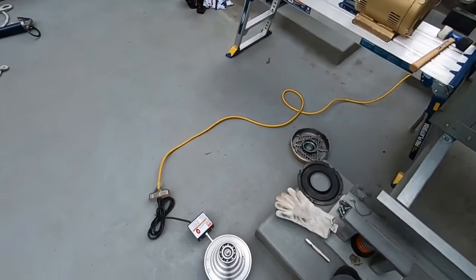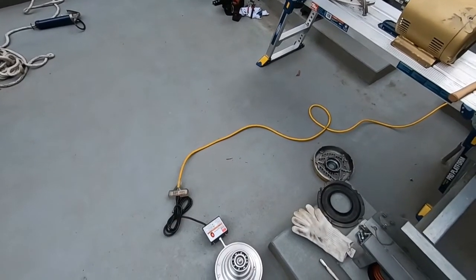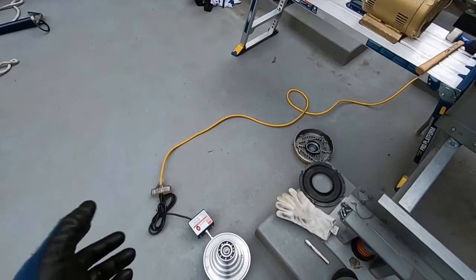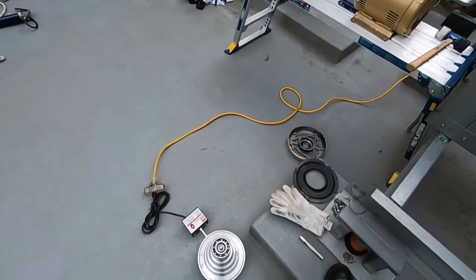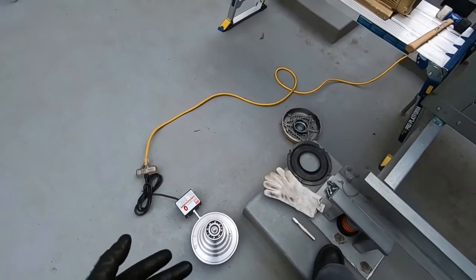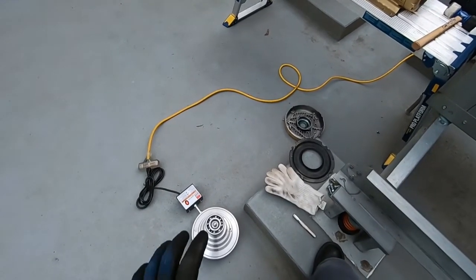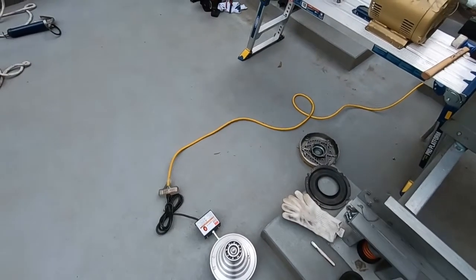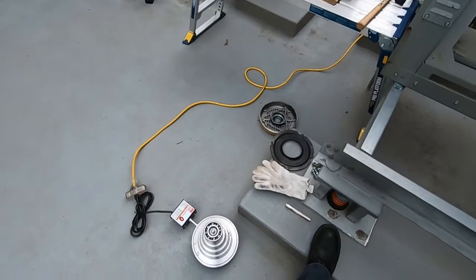Toaster or a small, you know, bake machine or whatever. And like I said, as long as you can get up to 400 degrees, I don't know how long it'll take. Usually on a little cheaper one, it might take a little longer to heat up the bearing. This one I probably had it on for maybe 5 minutes. Now I can already kind of smell it. And I know from right there, it's already getting pretty hot. But those small little toasters, you know, they will work if you need it in a pinch.